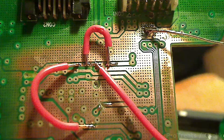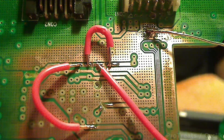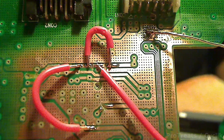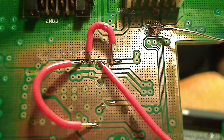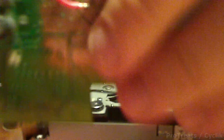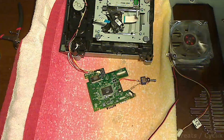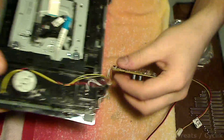I'm going to attach a diagram to this as well — I'll link to a picture that will show that same thing. Make sure that you get these right again. If you disconnected these little wires from these connectors, make sure you get them back in the right order. It should go yellow, yellow, white, white, red, black — right there.